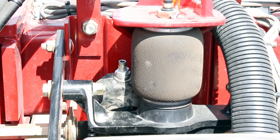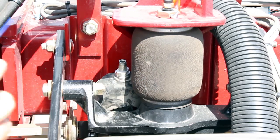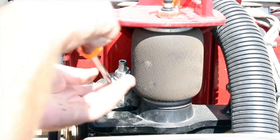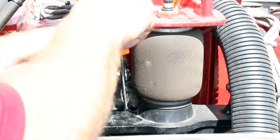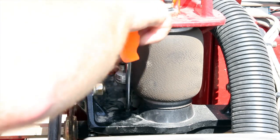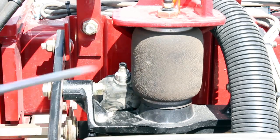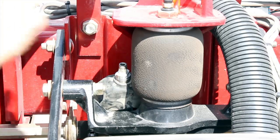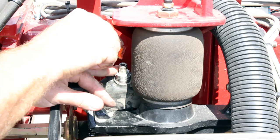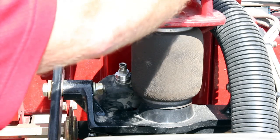What you want to do is give it about a two-second blast with your all-purpose silicone lubricant. Go ahead and put the screw back in — make sure nothing gets in there. A magnetic tip screwdriver really helps, especially in this situation when you've got pneumatic down pressure bags and there's not a whole lot of room to get in. Just get your screw tight — no reason to put a lot of heft on it, just get it good and snug. Next, we're going to take our Bimbalube and give it one drop. Don't want to put too much in, but give it the one drop that the instructions call for. Set that aside.